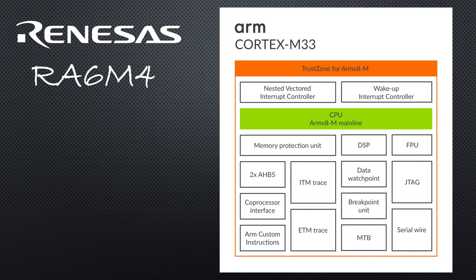Just to remind you, the Cortex-M33 was one of the original ARMv8 architecture devices, which came packed with goodies like the floating point unit and digital signal processing unit to accelerate these functions. There's also the memory protection unit that provides programmable secure memory regions, returning a fault when accessed by software without the right privileges. The big leap for ARM with these cores was in security, with TrustZone technology which provides hardware isolation of secure memory space zones to keep things like recovery code or encryption keys safe from software attack.